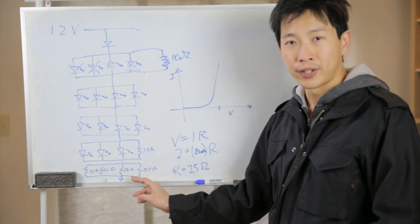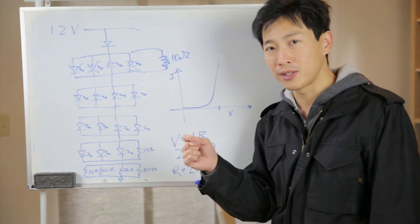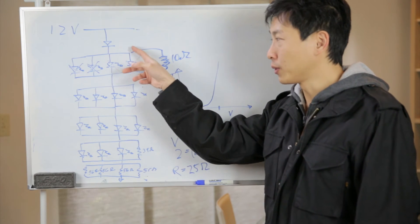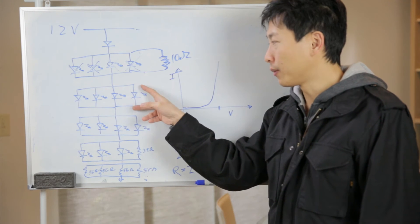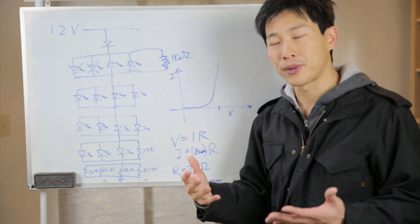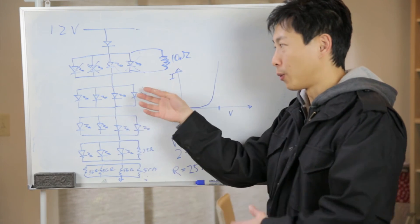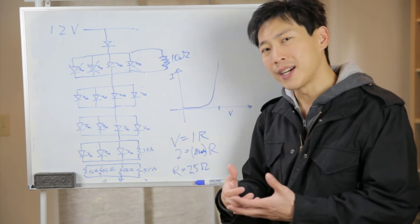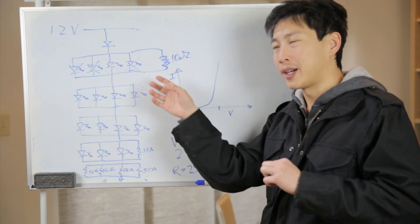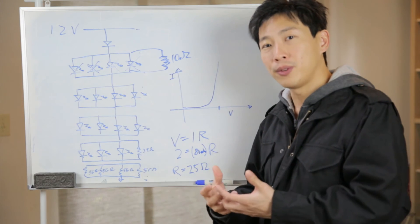So if you have an area of LEDs in a lamp module or a car lamp module, you can jump across broken LEDs but you cannot short them — you need to put a resistor there of the correct value. In this case I put about a 10 ohm resistor, and the voltage that developed across it is a little bit smaller than the voltage across the diodes, meaning I'm driving it slightly harder, but being 5 to 10% off is okay. The end effect is you'll have a set of LEDs that are burnt out but at least the rest will still remain on. It's not ideal if you worry about aesthetics, especially in a car, but for a lamp module where you're not looking directly at the LEDs, it's okay since it will just give you a slightly reduced brightness.